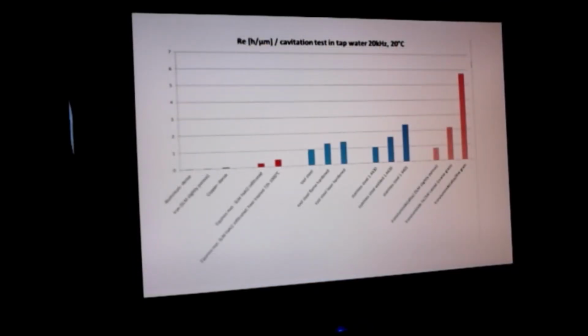All RE values from different materials line up, starting with the weak on the left side and the strong on the right side. New materials like the ones we developed in Equinox can easily be judged by looking at their position in the row. Other setups like hydraulic tests should give the same lineup of the row but can actually differ in the values of the numbers for the measured and calculated resistances.